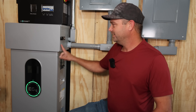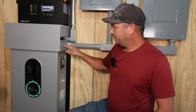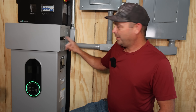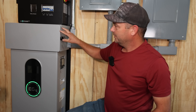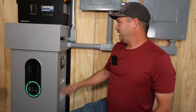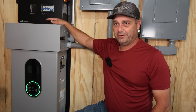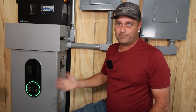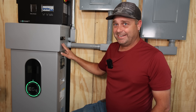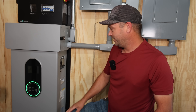I checked Signature Solar's website and found that this exact conduit box no longer comes with the indoor battery — they now sell this one with outdoor batteries and have a slightly different one for this battery. The main difference is the new one doesn't have a hinged door — it has a removable cover with four screws. It still has knockouts on the sides and top, which you can modify to match a non-EG4 inverter. I definitely think if you're buying this battery the conduit box is a must — it only costs about $98 and it simplifies the installation so much. That's a small price in the grand scheme of everything.